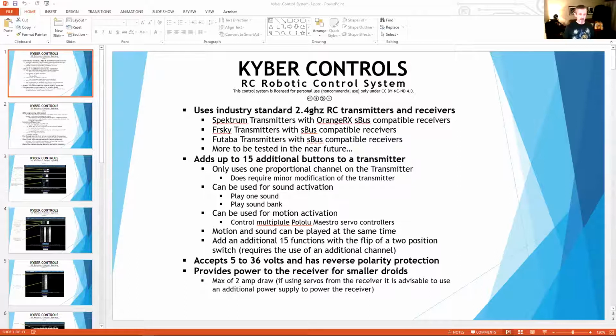He just has so much interaction, so many moving parts that we had to automate some of that stuff. So in the beginning, Stefan and I did something that would just work for Wally. It was just a pre-wired controller that was a separate battery system, used a different RF transmitter. We had a lot of issues with it, just being able to stay connected. It was like Bluetooth and some different things that we couldn't keep connected all the time. So we decided to come up with some other way of doing it with the RC, and then we thought about coming up with the potentiometer button bank, basically.